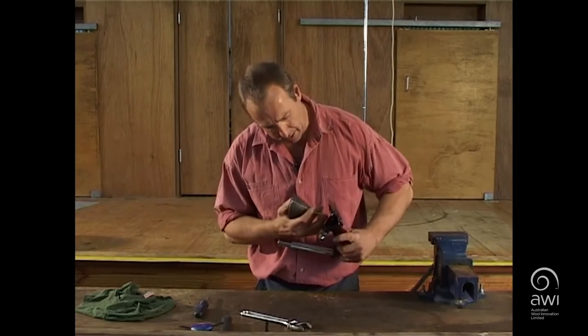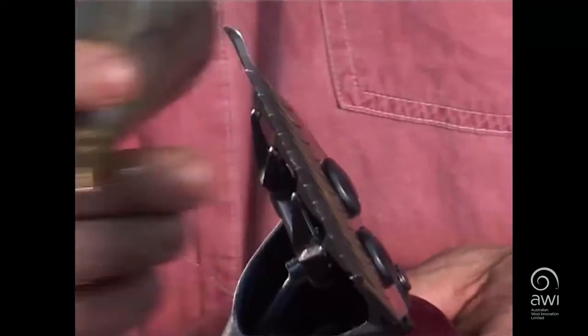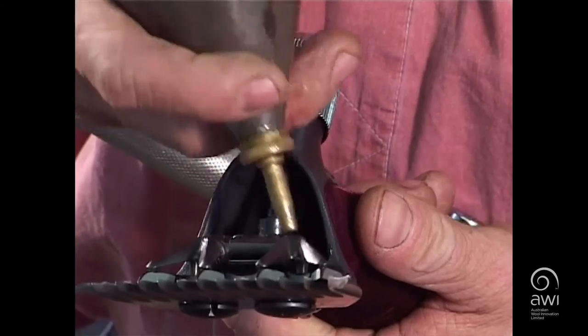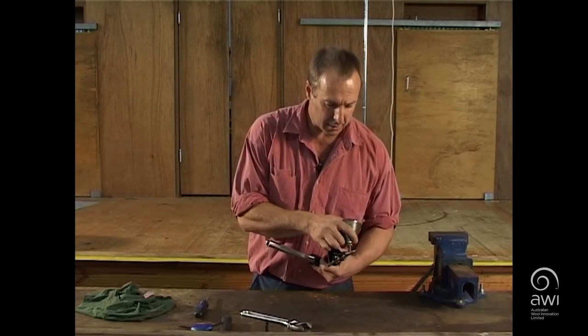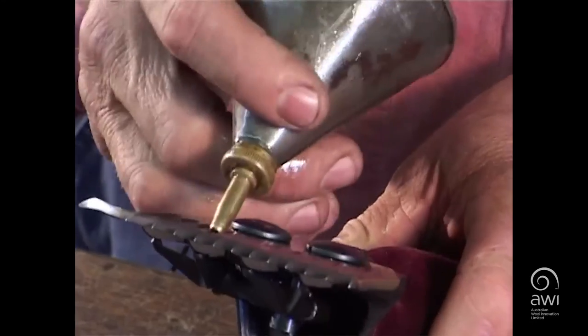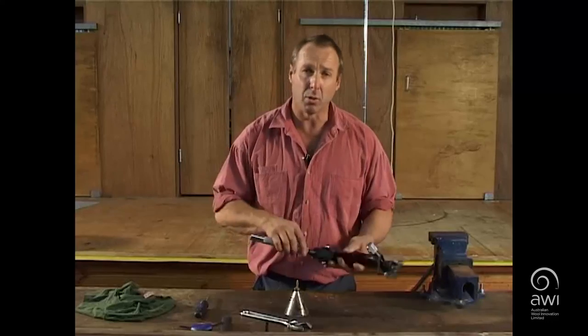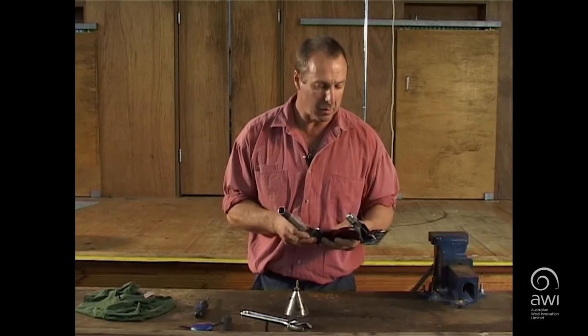When we oil the cup and post, we should be positioning it upside down like that, so the oil runs down into the cup. That again should be done every comb and cutter, or the start of every run. The same again across the chicken feet and for the cutters. So just through there or back through the back into the cutters like that. Again with the tension sleeve, we should be applying the grease at least once a week, but it is important that you oil and grease your handpiece to get that longevity and performance from it.